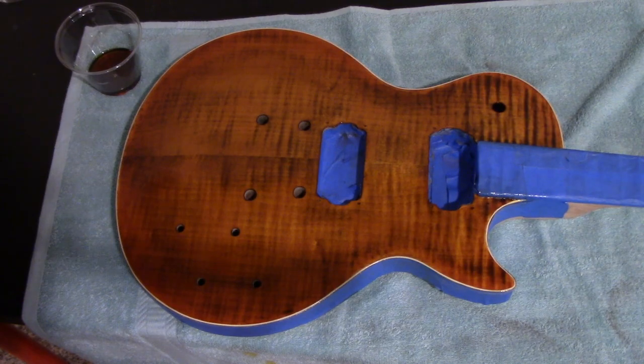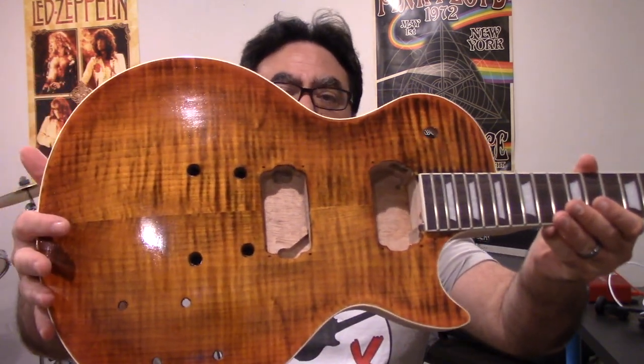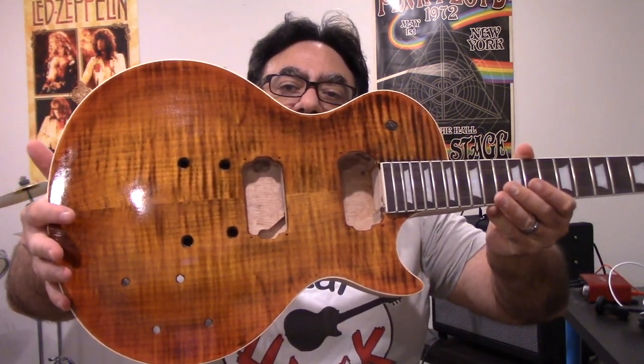I'm going to let that dry a little bit and then come back and put on another layer and keep going. When all is said and done, this is what it looks like — I haven't really polished it yet; that is just the True Oil finish on top. I used full-strength True Oil until the last two or three layers, then diluted it a little bit with naphtha, and that made a really nice glossy finish. I'll be honest with you, this is a labor of love — it takes a lot of patience and you really have to be careful if you want it to come out properly.